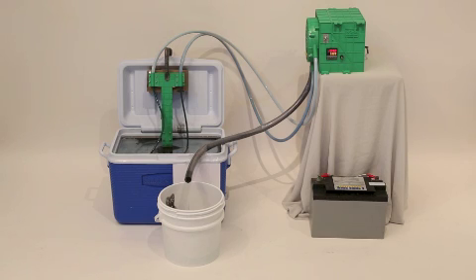You can see after just 20 minutes of running, not a lot is dripping out of the hose now. It's taken the majority of the oil off the top, which is really what you want to do. Now what it's doing is just cleaning up the residue. And even when the tank's completely clean, you can see just a diesel-like slick on the top of the water — really no heavy oil as such. Even still, it keeps drawing that away and up the pipe. Incredibly efficient.